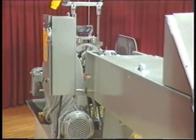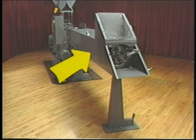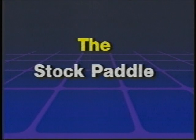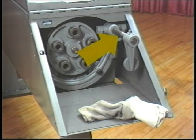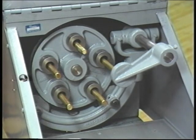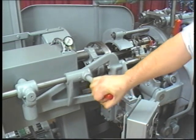On the left end of the machine, we have already pointed out the wire case carrier. The wire case carrier is a container for the bar stock or material which is fed into the machine. Adjacent to the wire case carrier is the loading rod and stock paddle. The stock paddle is used by the operator to manually insert bars of stock into the work spindles. It is located next to the wire case carrier, which extends out from the left of the machine and is controlled by the operator from the front of the machine.